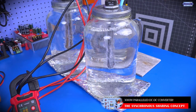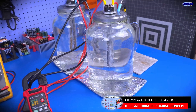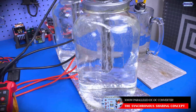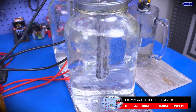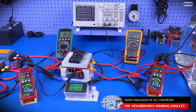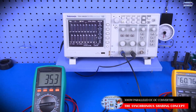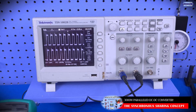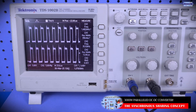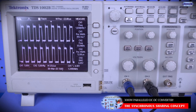What's going on here is that one of the converters is the brain of the system. It looks at how much output load we have and configures the PWM on-state duty cycle to adapt to that load, then shares that PWM signal with the second converter. I will be able to share all the schematics and everything we have done at the end of the series.